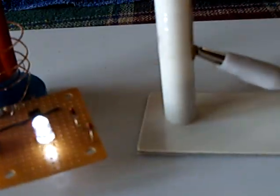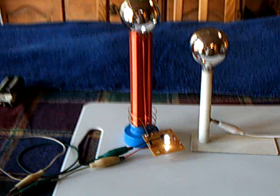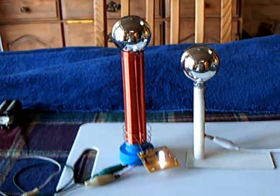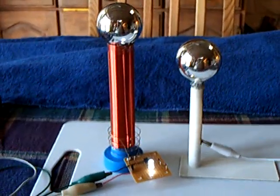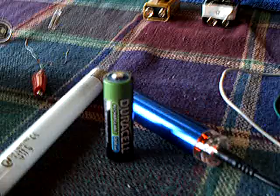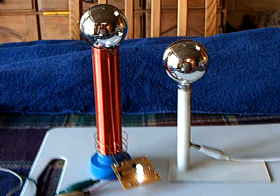This was a really fun little project. It's a mini Tesla coil with a little Christmas tree ball as the top load — a glass ball, not plastic, with a silver coating on the inside. You just take the wire off the secondary and stick it into the bottom of the Christmas tree ball to give you the top load. It's great for electrostatic experiments, and I even ran electrolysis off it today, which worked quite well. Remember, all of this is off one rechargeable AA battery, pumped up to about five and a half volts with that cell phone charger. Getting something to work off a single AA has always been one of my goals — fun little project.